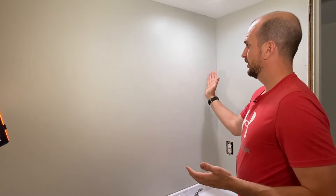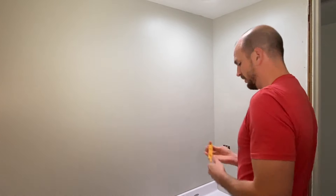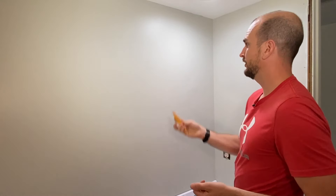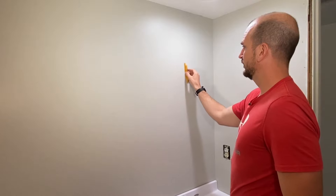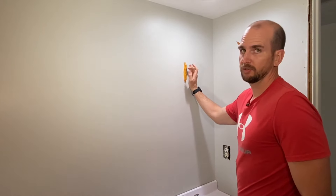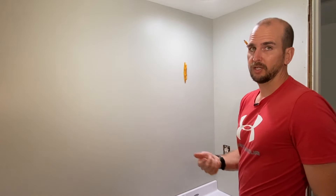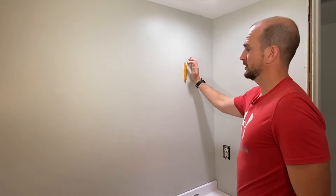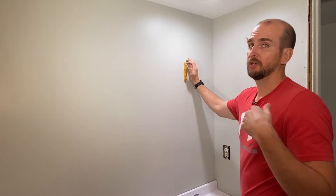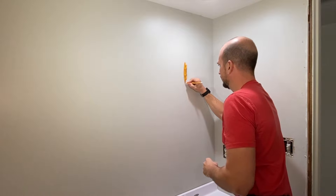Starting off I want to find where there's a stud in the wall because I want to hit at least one of the mounting screws into a stud. I'm going to use this stud buddy — it's a stud finder with magnets, so you just swipe it on the wall until you hear or feel it catch. What that's doing is finding a screw that's holding the drywall, which marks a stud in the wall. The stud buddy is awesome — super simple, no batteries, no issues. I'll put a link in the description. Now I'll just put some light marks on where that stud is so I can reference it for one of the mounting holes in the bracket.